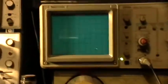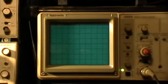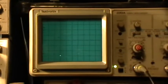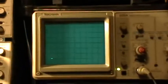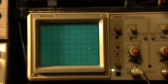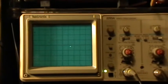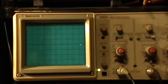There's the oscilloscope over there. You can see in the fast pulse mode this thing pulses once a second, and in the slow pulse mode it's once every two and a half seconds. That's the voltage on the capacitor right now, showing where the baseline is. Now I'm going to turn the unit on to the fast pulse mode. We're looking at that at 10 volts per vertical division. You can see a perfectly normal capacitor charge curve there — charge, pulse, charge, pulse — and it asymptotes at about 30 volts.